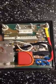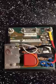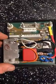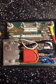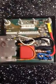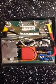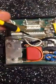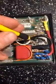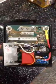Most of these components — actually all of them in here — you can still get off eBay. Most of the things in the pod you can get as well. It obviously just requires some skill to fix. Often stuff just looks burnt and you replace it and it's fine, but in this instance nothing looked burnt or damaged. It was just a case of checking the R1, then tracing it through the system to find what was wrong — which was the IC1 in the end. I hope that's of some slight use to people.